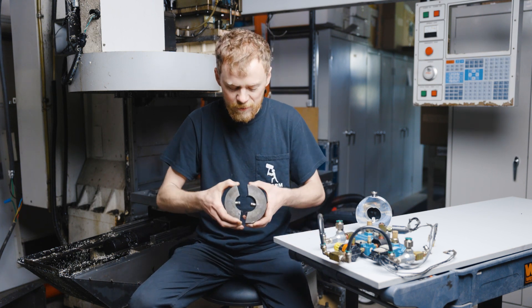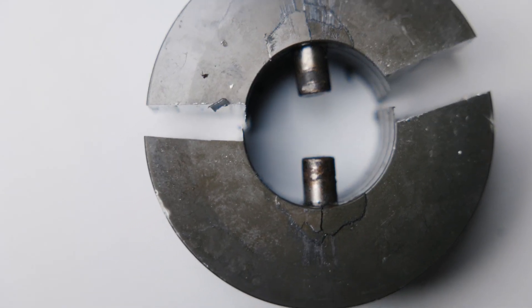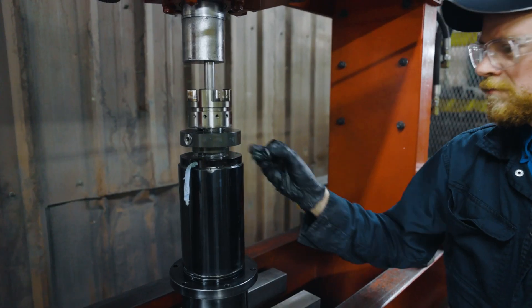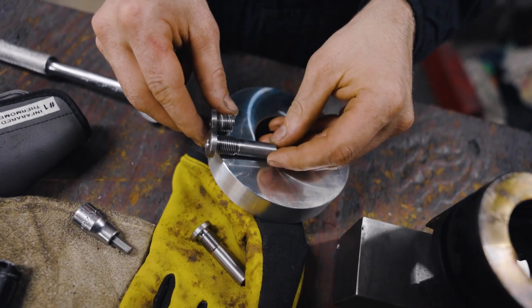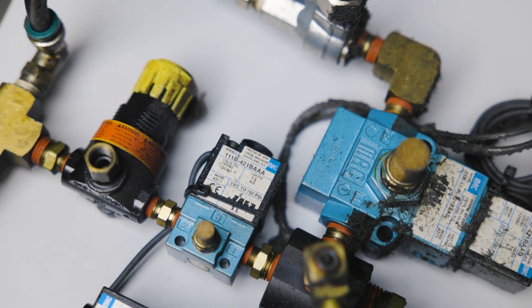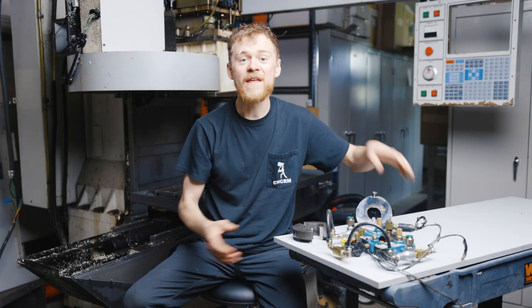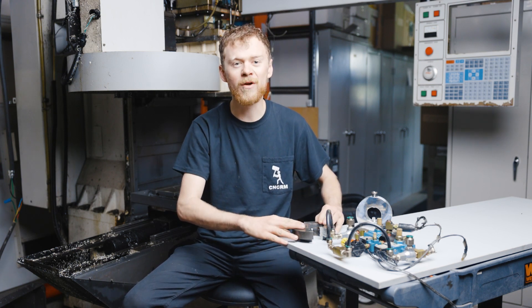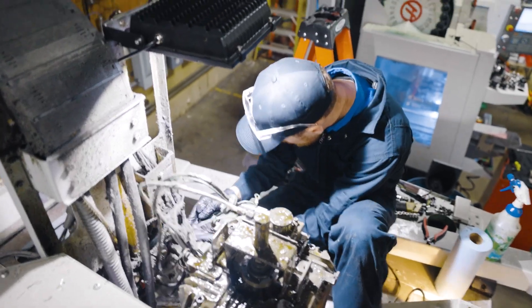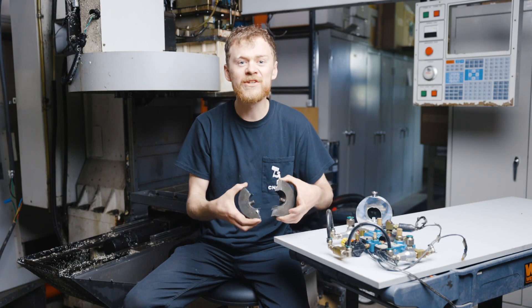To begin with, the issue was the drawbar ring on top of the spindle where the drawbar bolts go into the drawbar were broken, and this part here was cracked. The reason it's cut off is because I tried to remove the bolts from the drawbar and found out they were broken. The main issue that caused this spindle drawbar ring to break was this solenoid assembly here. This pre-charged solenoid applies air pressure at around 30 psi out of this regulator. That pushes on the tool release piston, which then contacts the top of the drawbar ring and will fully unclamp the drawbar. They had an issue with their regulator and solenoid, which was causing the tool release piston to bang over and over onto their drawbar ring, which eventually blew it out.